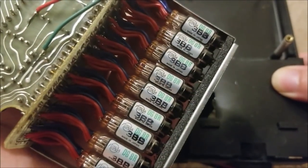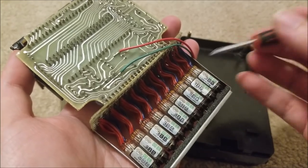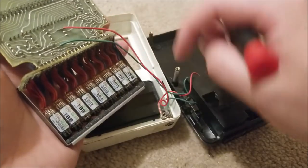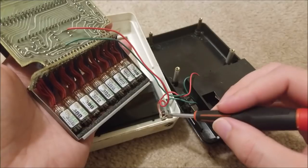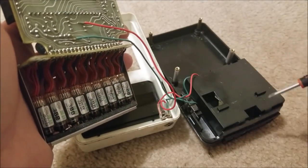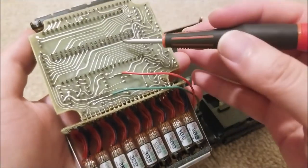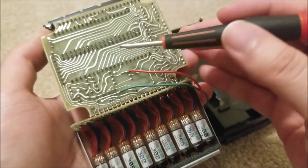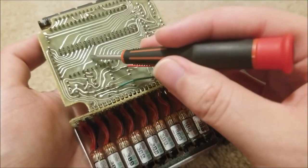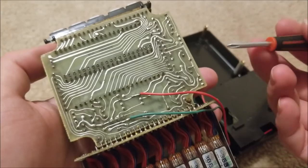Look at that — absolutely stunning. Beautiful glass wire interface for the frit on the bottom there. You can see the battery actually goes through this jack so that if a DC jack or AC adapter is plugged in, it disconnects the batteries. If no adapter is plugged in, the batteries are the primary source. We're going to have to desolder some wires from both of these, or just clip them off and splice a new battery pack in. This sort of looks like a hand-taped kind of FR4 PCB — there's no solder mask, and it's tinned. You can see it's silver there, and there's some extra solder on some of the pads. This is pretty in line with what you'd expect from the 70s and 80s.